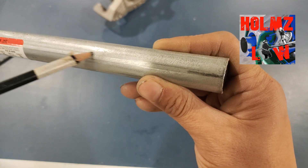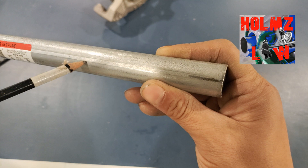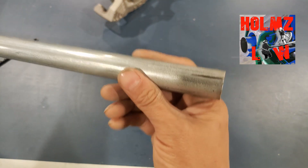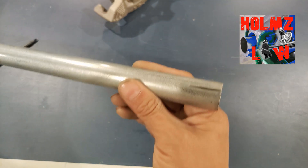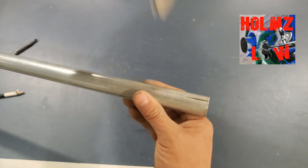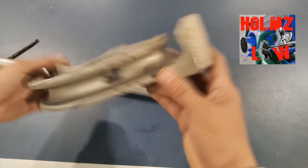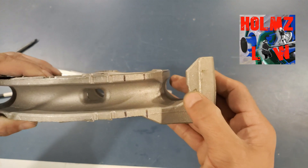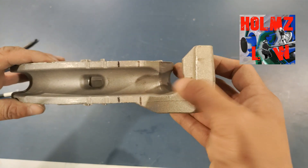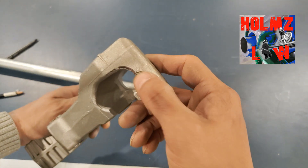So you pick that — that's the center of your whole pipe. What you want to do when you're doing an offset is use that second line on your bend. For the first bend on your offset, you want to do it on the side where the seam isn't. You'll line up your pipe with this mark because it's going to be a little easier for you. You can actually line up your mark, depending on what kind of bender you have, with the center of the shoe. They'll have an arrow. If you don't have the Klein bender, you can put this mark on the front — just make it the center of the shoe. Also on the front, you have this little arrow that shows you the center so you can line up that mark with the arrow on the Klein bender.